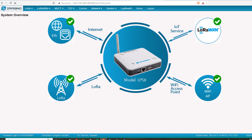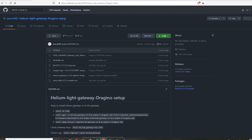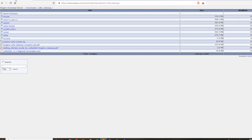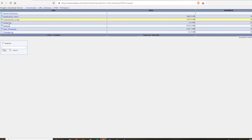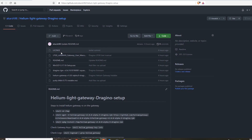You can see all green text — that's a good sign. To onboard the LPS8 to the Helium network, make sure your firmware is the latest. Mine is currently the latest. If yours isn't, go to System and click Firmware Upgrade. Upload the firmware file which you can find on my GitHub. If you're watching this video later and need a different firmware, select your correct gateway from the Dragino repository — LPS8 for me — then go to firmware, then releases, and download the latest release based on the date code.